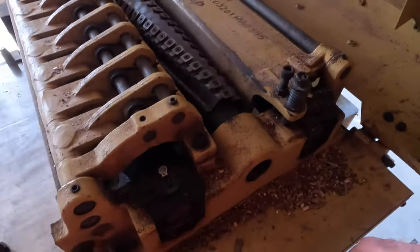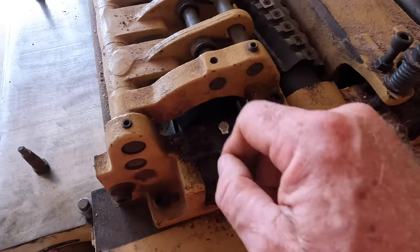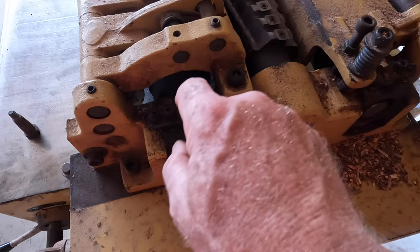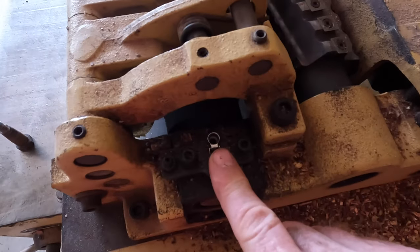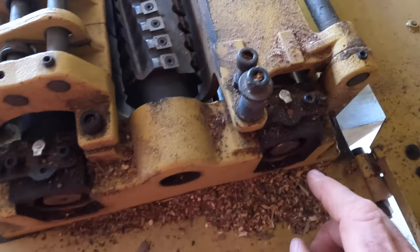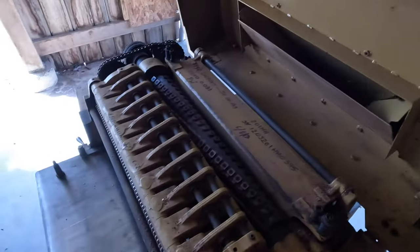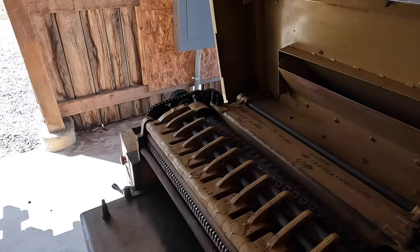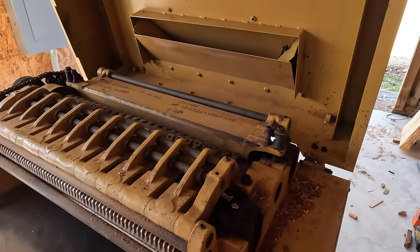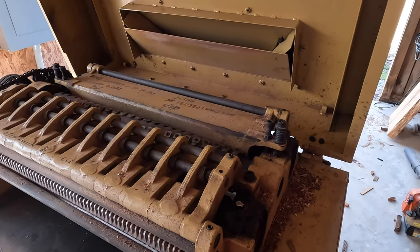Now, one thing that you might notice is a lot of the industrial planers don't use permanently sealed ball bearings. They use lubricated ball bearings, so you pour oil in about every week or so. The reason is that in an outdoor environment like this, you can get condensation in the bearings, and they will rust out or corrode out.